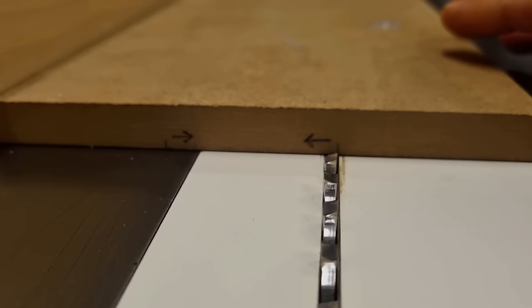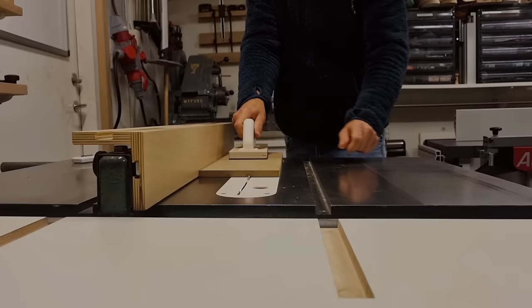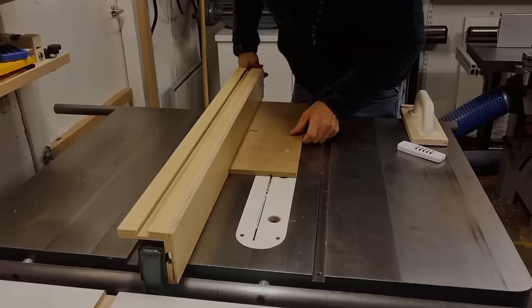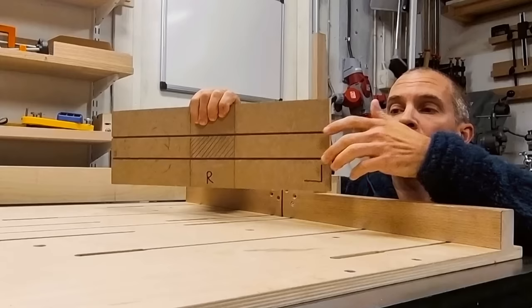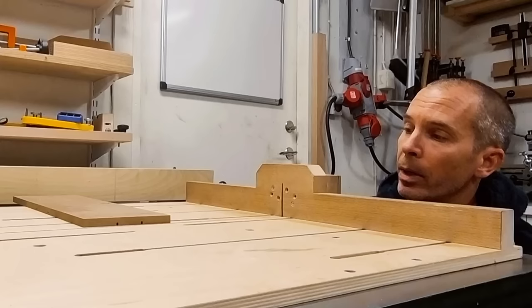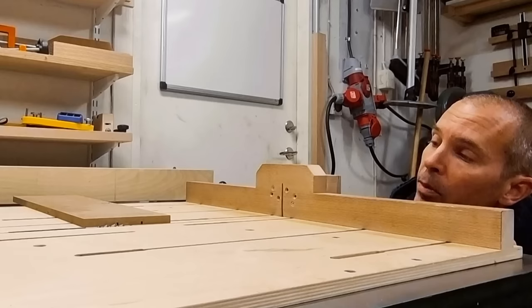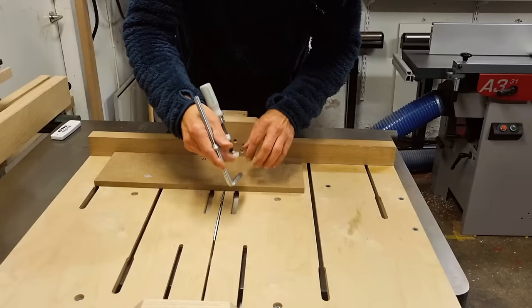I cut so I just touch the line and stay inside my lines. The shorter cuts I make on my crosscut sled — you could also use a mitre gauge. If you use the crosscut sled, raise the blade height slightly to compensate for the sled thickness, and you don't have to match the first two cuts exactly — just set it roughly the same. As with the long cuts, keep the reference edge against the fence and cut inside your lines.